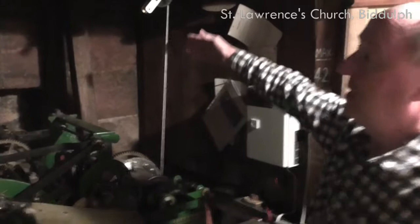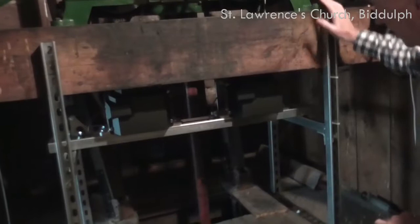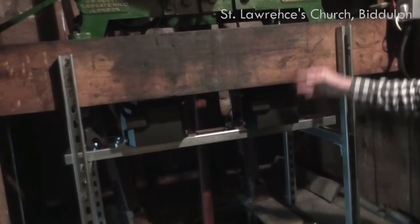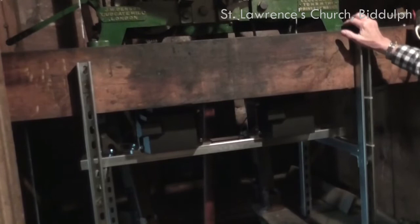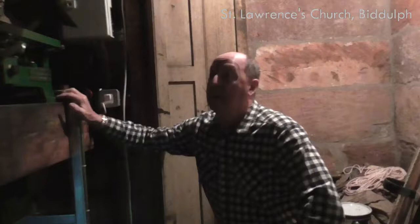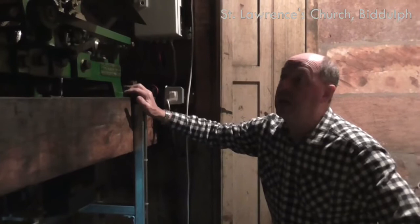and new cables. And we go down underneath and we have two 12 volt low geared motors with its own weights now, as the old weights are redundant, and this keeps the clock going, and it does exactly the same thing without us climbing up here every week to wind it up. Apparently it winds itself up twice a day.